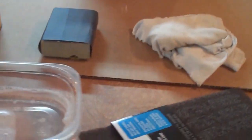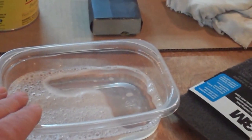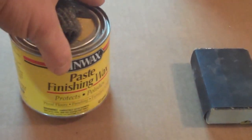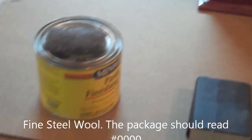What I have are my materials. I have some warm water with soap in it to kind of lubricate the sanding process. I have a 400-grit wet-dry sandpaper. You can also use these industrial — what my wife calls scrungies — they're for between coats of surface polyurethane or lacquer and you can use that as sanding paper, but I'm more comfortable with the sanding paper. And then I have my paste finishing wax and some 4-0 steel wool, and that'll be for the other application.